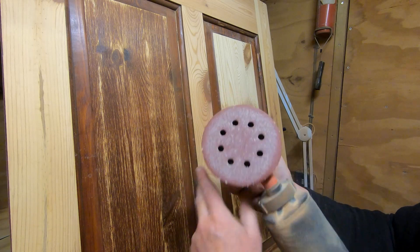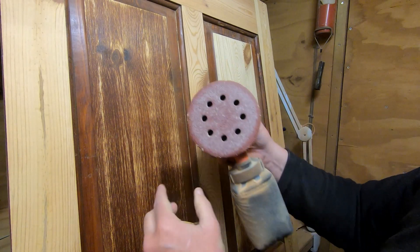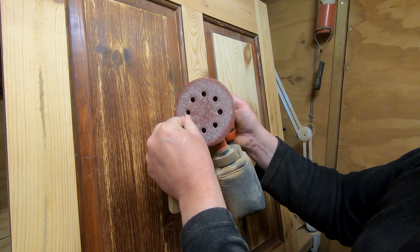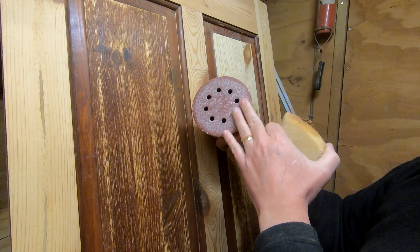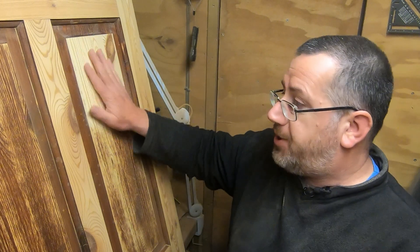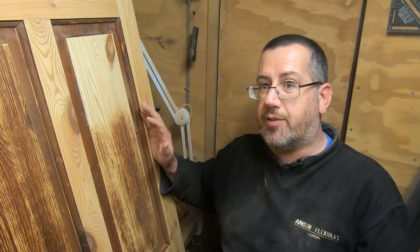You can see what's happened with the paper now - we've got rid of most of the stain and gone back to bare wood, which is why most of the dust on here is now white. White dust doesn't cause those harder bits, so you can sand longer and the heat build-up isn't so bad, but I'll still clean the paper to revive it so I can carry on. Having that rubber pad to clean the sandpaper off is a real lifesaver. To be honest, from just what I've done there I could have almost reached the point of throwing the sandpaper away had I not cleaned it off, and I'd only been using it for a few minutes.